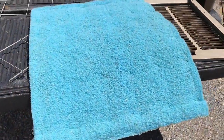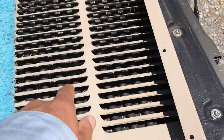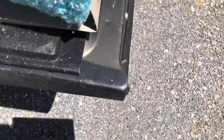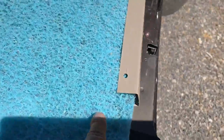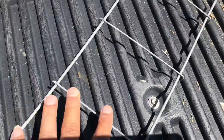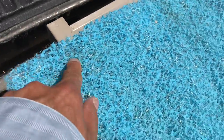So it's time to put the Dora Cool pad into the panel. Make sure you shake this out first — shake out all the old straw. All you do is slide it over to the right part, slide it in there, use your fingers, and just push it in. As you can see, this one's a lot bigger than the design, so we're going to have to cut this one. We're going to cut it right here and along here. Cut it a little big because remember these are going to be pressure-fit in, so it's better to cut it a little big than too small.